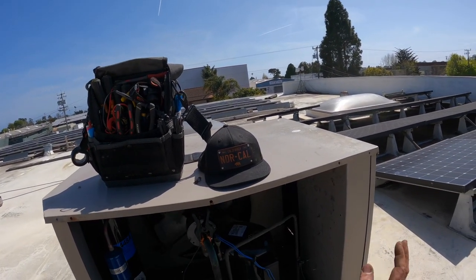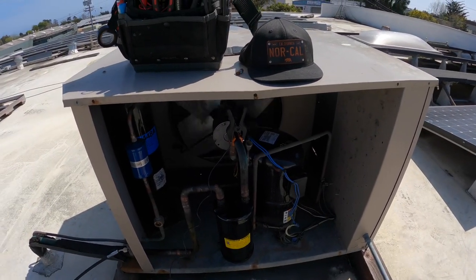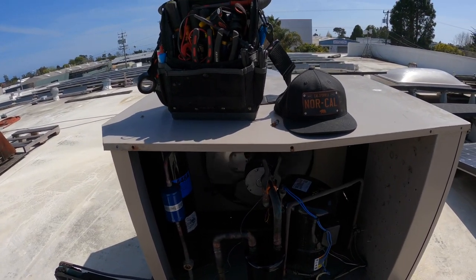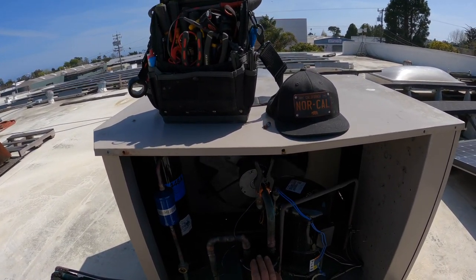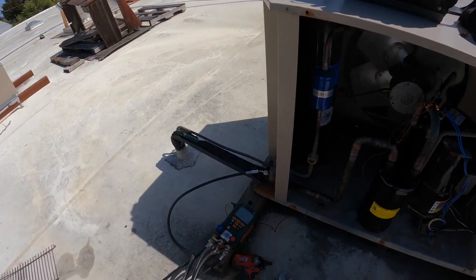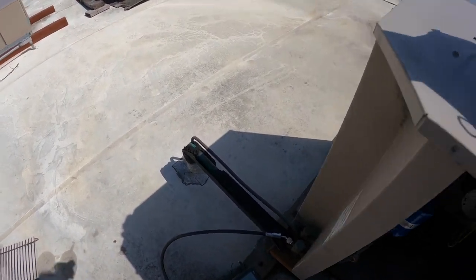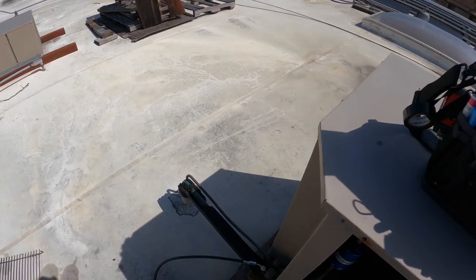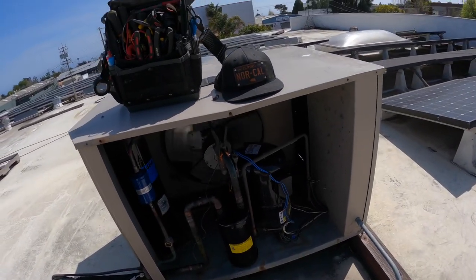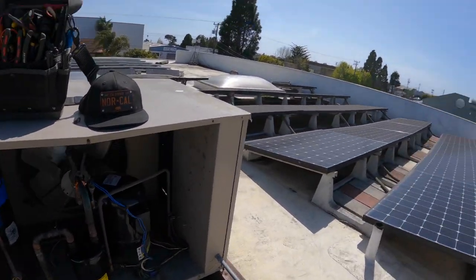absolutely, positively sure that flooding back killed the old compressor. So now if some maintenances get missed and the coil's not getting washed out super good, we got a little bit of a safety here with the accumulator. And yeah, got me some compressor superheat now. It was actually reading below 20, so. That's my follow-up on this job.